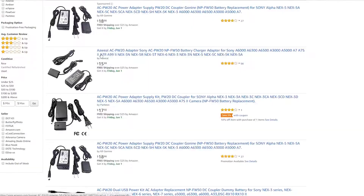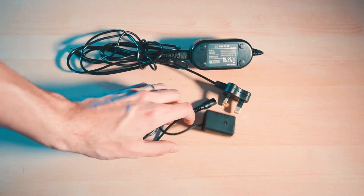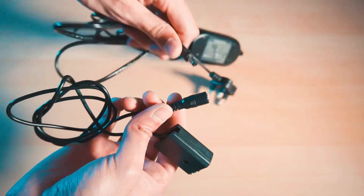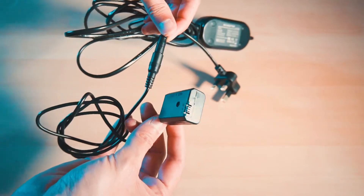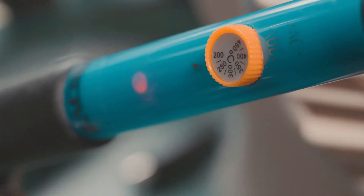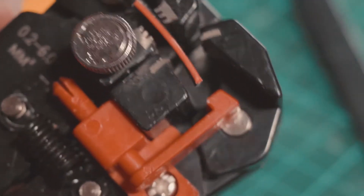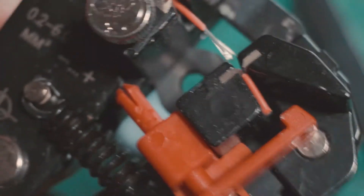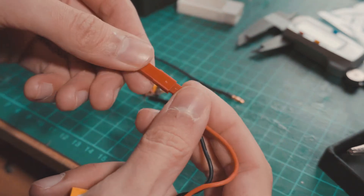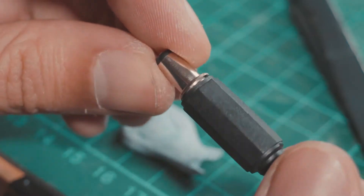You will also need an AC adapter that you can buy off eBay or Amazon. This is composed of two main parts: the AC to DC converter, and the battery emulator — which is shaped like a battery but powers the camera through the AC adapter. This is the part we need for this project because we are going to plug our system into this cable. You'll also need a soldering iron and some solder for a professional finish. Depending on the battery you plan to use, you'll need the appropriate connector — in my case, the XT60 female connector. And finally, you'll need a standard DC connector, also linked in the description.